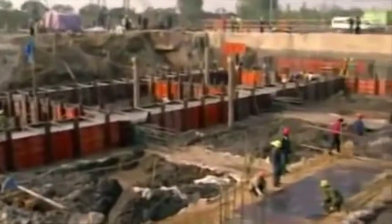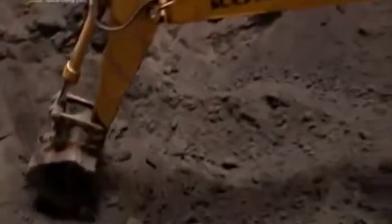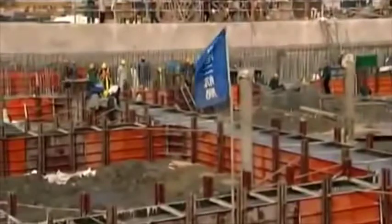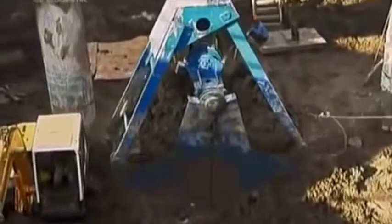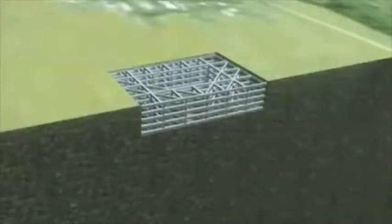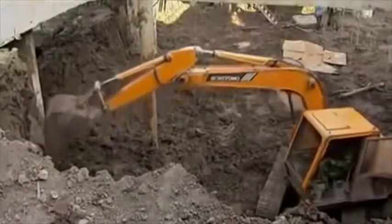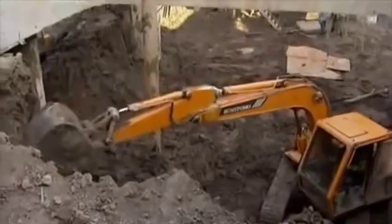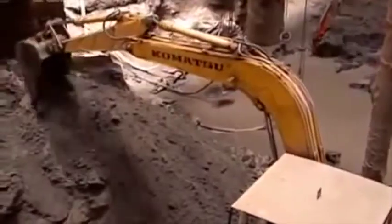With groundwater no longer circulating inside the two sites, the soil became safer to dig. The excavation went on 24 hours a day, as the crews tried to finish before the summer floods threatened to fill their excavation site with water. These enormous pits would descend at least 30 meters, but every four meters, workers needed to stop to pour concrete braces. The deeper the workers went, the more dangerous the job became. Groundwater was constantly pushing the walls towards collapse, and the deeper the hole, the stronger the pressure.